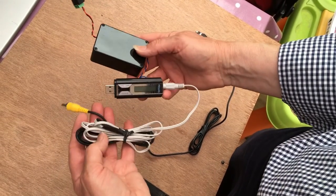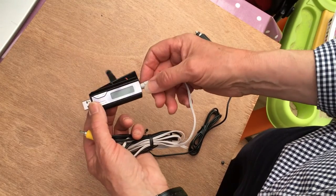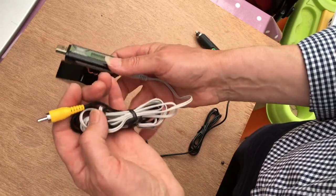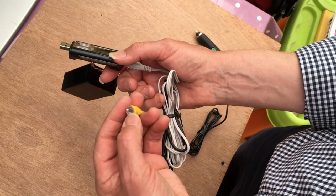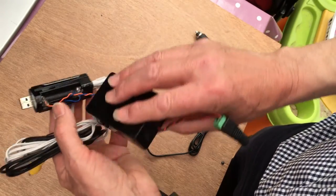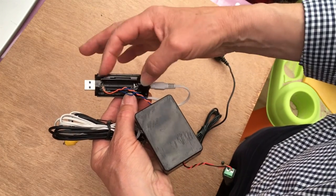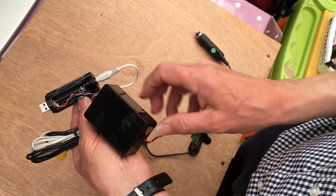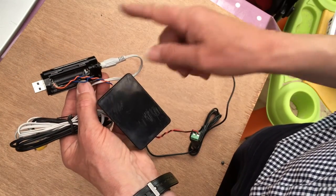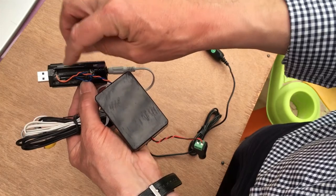Just to give an illustration on the MP3 player — here we are. The sound is downloaded via PC through the USB cable. When it plays it normally plays to headphones, but I've taken a headphone lead — the coaxial type — and joined it to an audio lead with a yellow RCA or phono plug on the end. That plugs into the amplifier. Normally the MP3 player would have a 1.5 volt battery, but I've taken a wire out from the battery terminals — soldered it on — into this box of tricks, which is another voltage regulator. This time we take 12 volts in and get 1.5 volts out, so the 12 volts goes in and the circuitry transforms it to 1.5 volts, which keeps the MP3 player going.